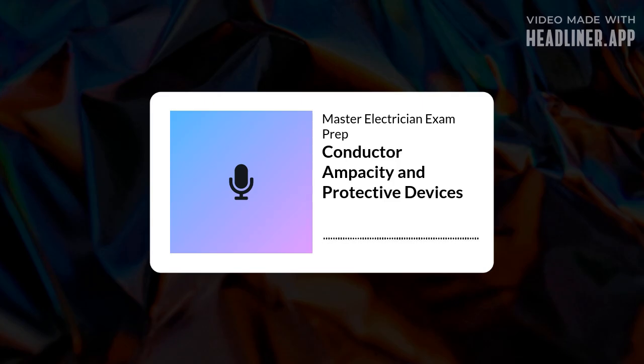And circuit breakers, the resettable ones. They're automatic devices. Trip on overcurrent, you can reset them once the fault is cleared. Common residential breakers might have a 10,000 AIC rating. AIC. Amperes interrupting capacity. Which brings us to a crucial point. Interrupting capacity, section 110.9. Critically important.